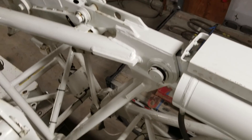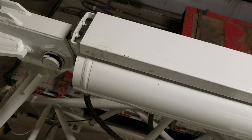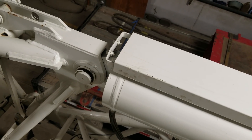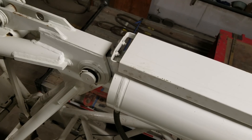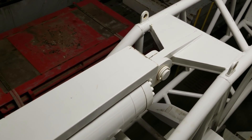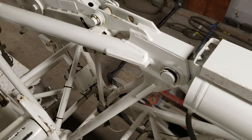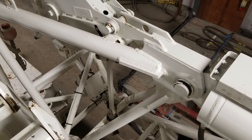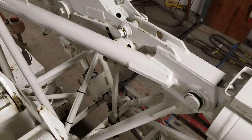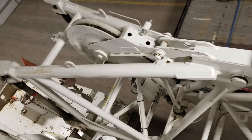That's what a hydraulic luffing jib is. If this hydraulic cylinder wasn't here there would be a steel link with various pinholes and you'd pin it at 0, 20, or 40 degree offset — physically pinned, not adjustable. But with the hydraulic luffer it's infinitely adjustable between 0 and 40 degrees offset. There's the hydraulic luffing jib for the ATF 180 G-5, all 43.3 feet of it.